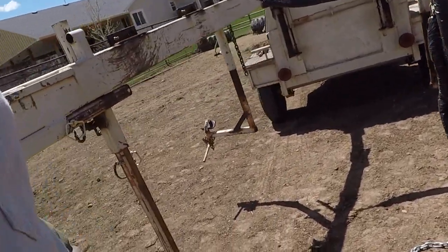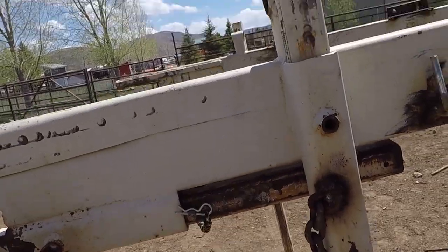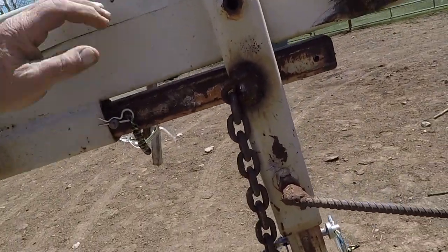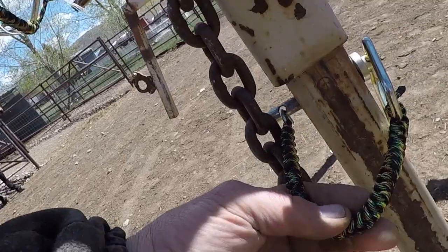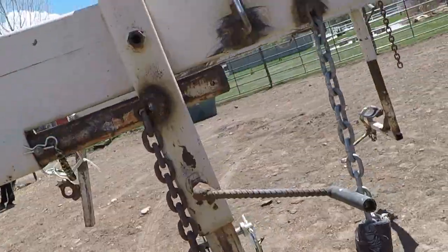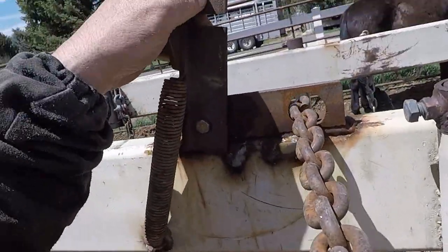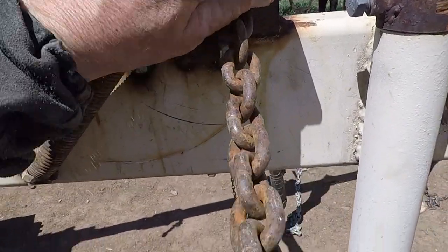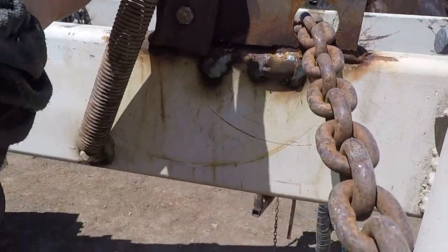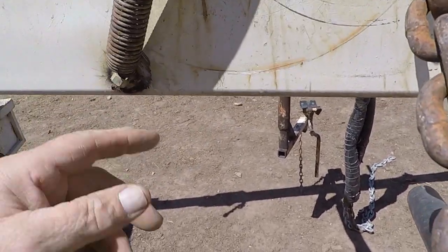Last time we were here I had a couple things I needed to work on. I ended up putting a chain that'll go behind the mule. I put some safeties on - drilled some holes in these so that if they get bounced around they won't drop. Put some pins, got a little snake knot there on some parachute cord to keep my pins together. Over here we got the chain latches - I had to revamp them. The mule or horse would get bouncing and these would come undone, so I took a trampoline spring.